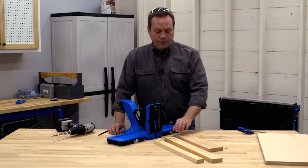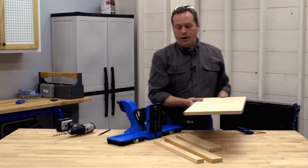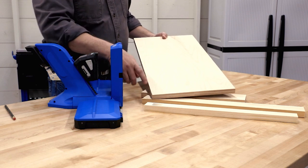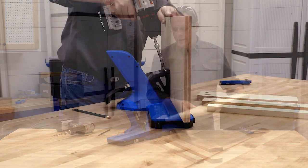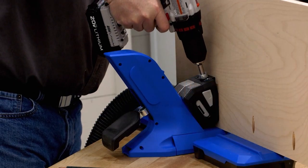For when you're working with a long board or a large panel, it's pretty straightforward. We recommend a hole about an inch from the end and then every six inches or so in between. You can use any of the drill guide holes as you drill these pocket holes.